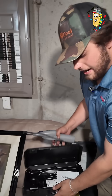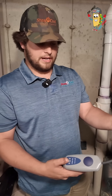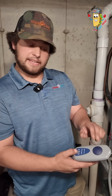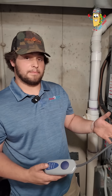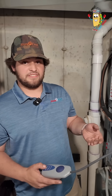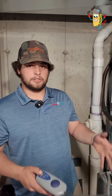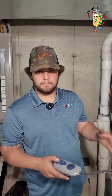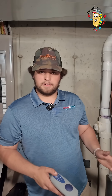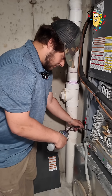Here's one of the many tools we can use to find refrigerant leaks. This tool heats up a diode inside — it's basically smelling for trace amounts of refrigerant. Once it hits those amounts it should beep very fast, which helps pinpoint where the leak could be. It's not a dead-on method, but if it can point us in the right direction, that's terrific. We'll start with the sniffer test and go from there.